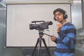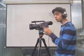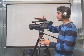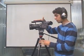I can record Arjun's voice at different volumes based on how I control the volume knob. Notice how I can control the audio levels from jumping into the red with these knobs, and his audio gets recorded on both the channels. This is a little useful in case on one channel the audio gets distorted but you still have a backup on the other. Notice these two are off and hence I have no ambient sound.